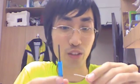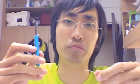Most of you will know that wire wrapping isn't that hard, except for the part where you have to strip this wire wrapping wire, which is very thin. So basically, these two come with a little stripper here. So what you do is you put your wire through the stripper, and most people will just straight away pull it out, and you will get very bad stripping.